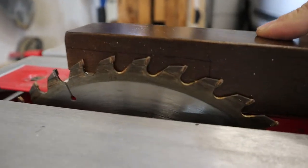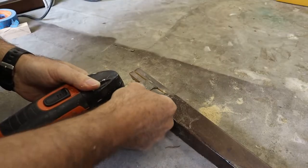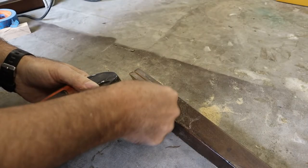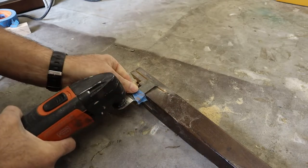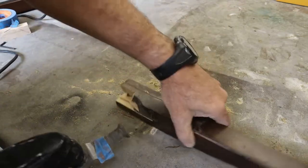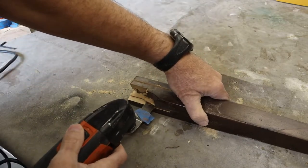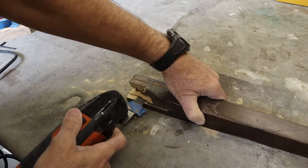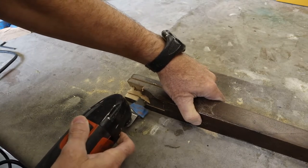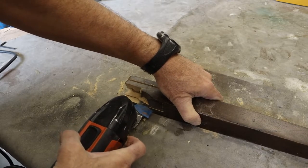When we're doing this, you want to make sure that your cuts don't go past where the saw blade teeth will extend. The next thing we want to do is use a reciprocating or an oscillating tool with the saw blade on it to reach into those tight corners of the cuts where the table saw blade could not reach. We use a piece of marking tape on the edge of the blade to mark the depth so that we don't cut any deeper than what that cut needs to be.